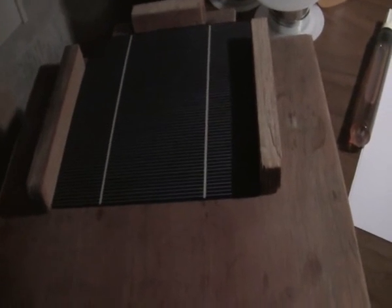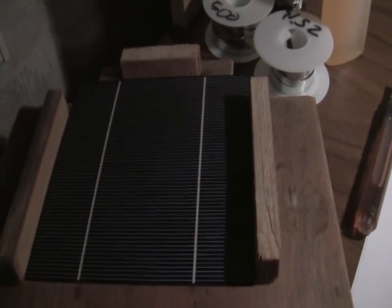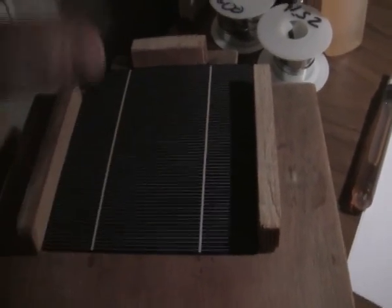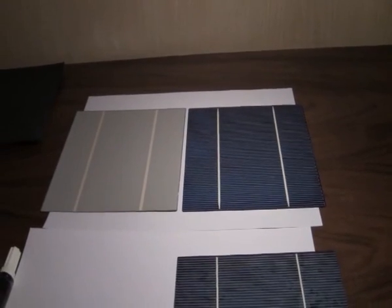One last thing about the template: the material should be hard — like wood, steel, or glass. It should not be soft, like paper. You have to remember that when you apply hard soldering pressure on soft material, there are more situations where cells break. I will show you in the next video how to tab them using the soldering iron. I have all the elements needed — thank you very much for watching, see you in the next video, bye!